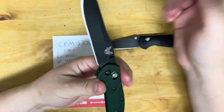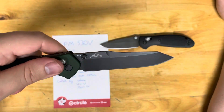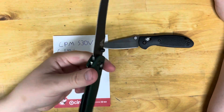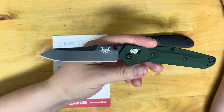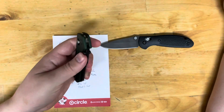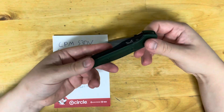This explains why high-end cutlery companies switched from 440C and 154CM to S30V — the machinability is so much better, and knife users notice that in sharpening too. When sharpening S30V, it doesn't take the sharpest edge, but it will keep its bite due to the carbide volume. Even up to a higher mirror polish, it keeps the bite because of that carbide content. I've noticed S45VN does the same thing.